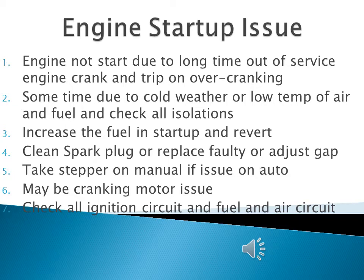Then check your air circuit — including the air filter and turbocharger. For the fuel circuit, check your fuel regulators, governor, and stepper motor fuel gas regulator. If you have a pre-chamber system, you will also check the admission fuel gas pre-chamber regulator.